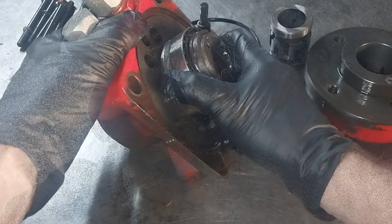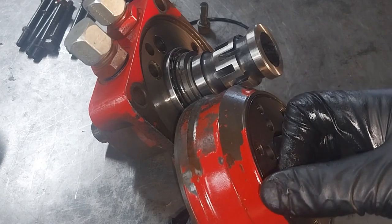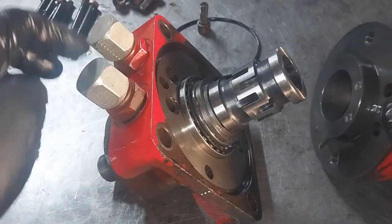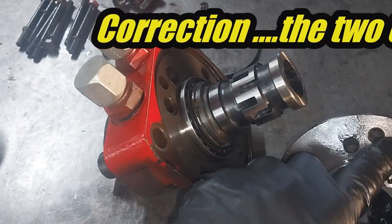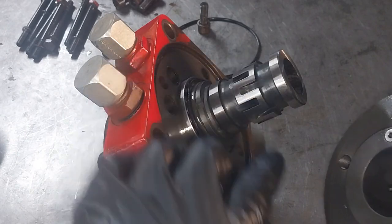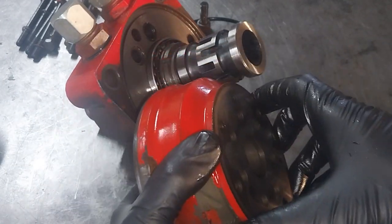The principle of this unit is: this shaft with the bearing is pressed fit into there. This is called a distributor — it actually rotates with the shaft. This valve block fits over the distributor and bolts onto the drive flange. It's a quite high-tolerance fit, because it actually distributes oil. Oil comes in through these two ports, gets distributed through here into these two ports, through these two o-rings for sealing, and comes into the inside through those internal ports.